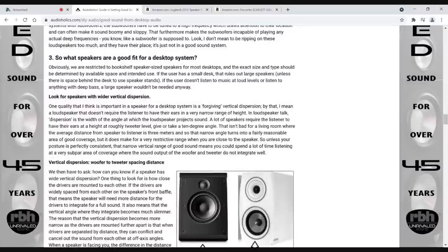In this article, we get into the dispersion characteristics of the speakers. James recommends wider vertical dispersion speakers because you're sitting really close — you can hear tonal changes if you stand up or sit down if the speaker doesn't have wide vertical dispersion. An MTM — mid-range, tweeter, mid-range — is a great speaker for home theater, but in a near-field environment it's not ideal because of off-axis lobing vertically, which is purposely done to control high-frequency dispersion for ceiling and floor reflections. So MTM is not the right speaker for the desktop.